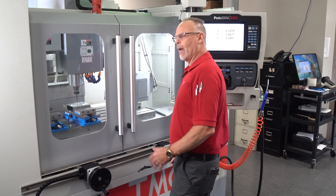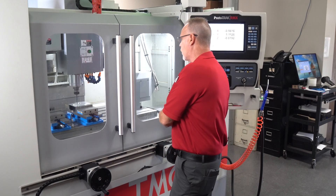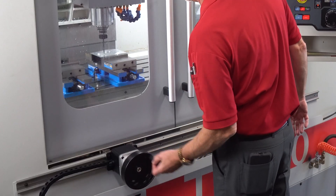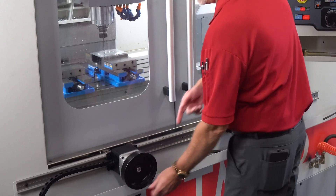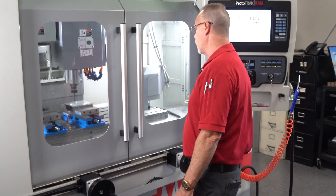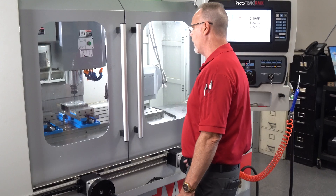While I'm in tracking, I've got both coarse and fine feed. The coarse feed is the X-axis hand wheel and the fine feed is the Y-axis hand wheel — the fine is four times slower than the coarse. So if I walk it quickly through here, I do want to point out one very important thing.